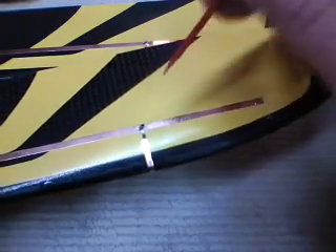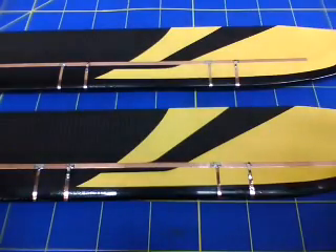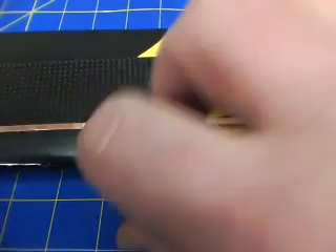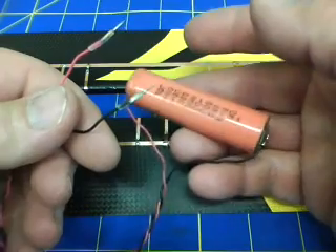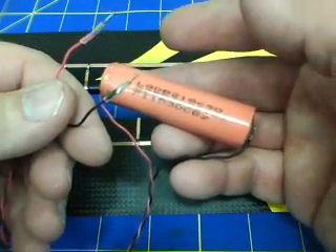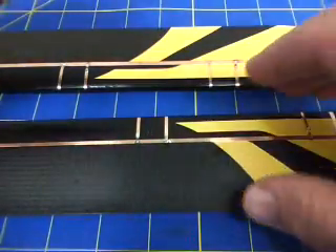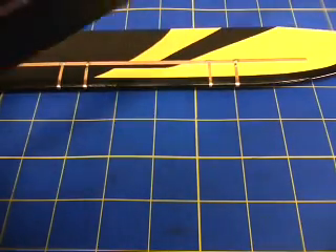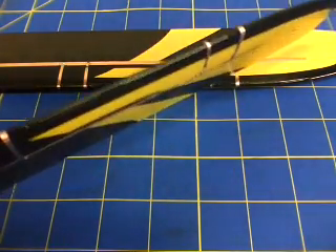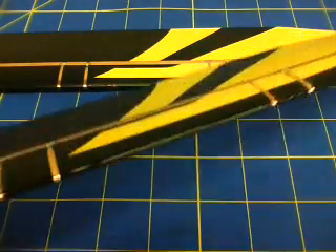What we're going to do is electrically test everything first. You can go back and do the gluing right before you do the clear coat, technically. At this point we've got all four LEDs in place and all four traces in place on each blade. A nice little handy item to have around is this lithium ion cell — it's 3.7V, same as a LiPoly as far as voltages are concerned. I've already got a set of leads attached to this thing. It just lies around my bench for testing, obviously for building blades and other things. It's something you can use to power up your blade before attaching the battery and the switch, just to confirm the LEDs are working. I'll touch one on the negative, one on the positive trace. There's a pair of greens. There's the red and the blue. Blade number one, good shape. Top trace is positive on the blade. Hold that on the positive, hold this on the negative — again, two greens glowing, blue and a red.